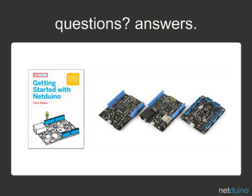But yes, absolutely, the architecture is designed to support 8 of anything that you plugged in, 8 RGB LEDs, 8 GPS receivers. As long as you have the milliamps, the actual amount of current to power those things, you're fine. And the DC-DC power switch that's on the main board is designed to turn the 500 milliamps of USB power into more than that in 3.3 volt, which is what most of the things in the system run on. It's very power efficient. It runs pretty cool.